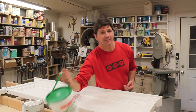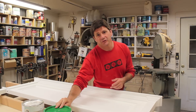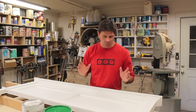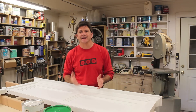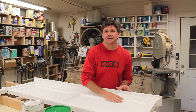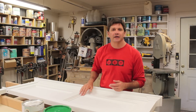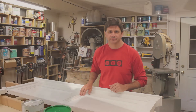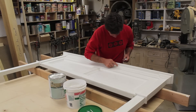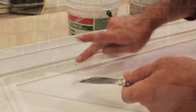What I like to use for wood fill is joint compound — just everyday spackle. That's a little trick that my buddy Steve, who's a house painter, showed me, and I've been doing the same thing for a couple of years. What's nice about it is it sands really easily, so as you sand the primer it's easy to sand the spackle at the same time. The next step is to just go around and fill any of the little nail holes.